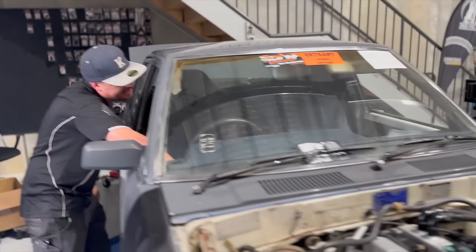First start after replacing the head gasket went smoothly, apart from the cam sensor being swapped around, but we got it good. Now Kai's replacing the diff. If you remember when I was at Road Trip Drag Challenge - actually that video hasn't got too many views so if you haven't seen it, click the corner - Kai broke the diff in the K and it threw the camera in his face. The spare center that's in the car is very noisy and Kai has built another diff, so while it's here on the hoist we're going to swap the diff out, then throw it on the dyno.